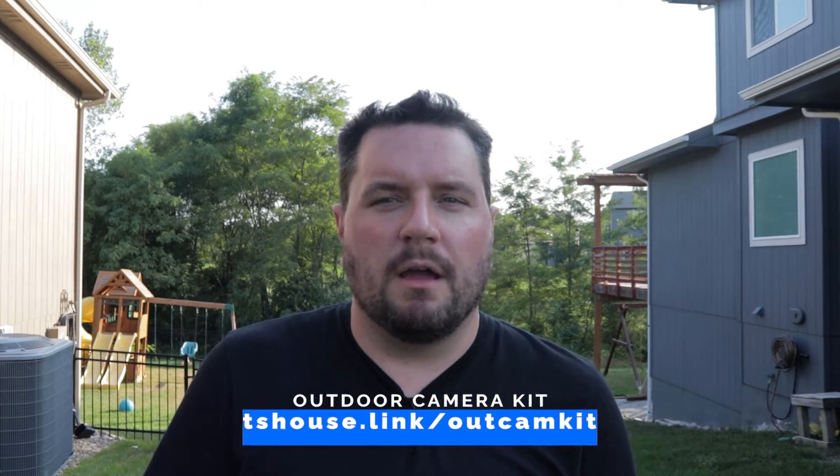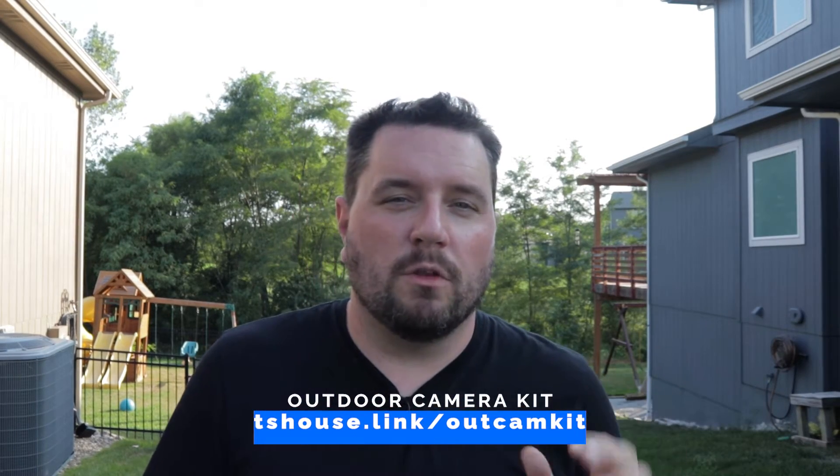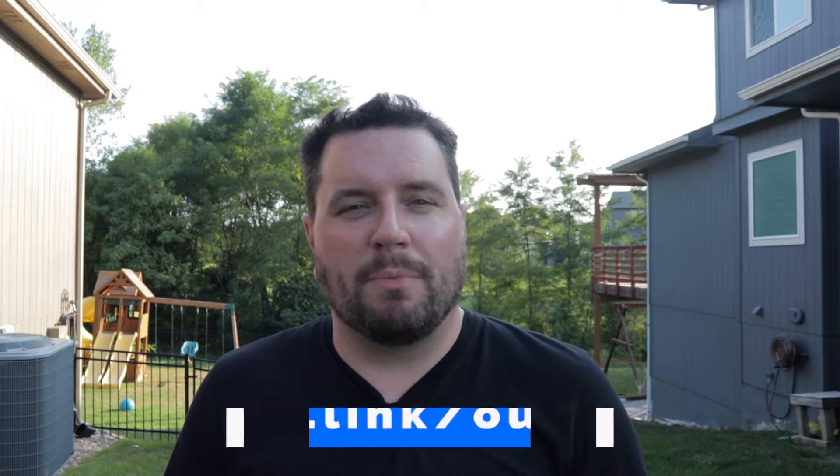I'll show you some tips in a little bit on how to make sure power over ethernet will work for your particular application before you run it and climb up on a ladder. I've got links to some power over ethernet adapters. In a previous video on the Wyze version three cameras, I talked about a special power over ethernet adapter that can be used for any type of micro USB connected device, similar to the Wyze cameras. On today's video, we're going to be using one that converts to a 12 volt barrel jack connection, most commonly used in cameras. I'll link some examples in the description and on Amazon.